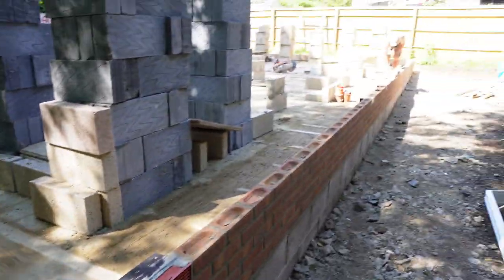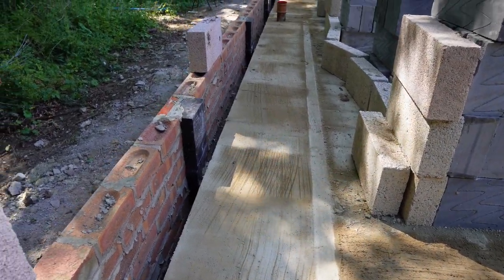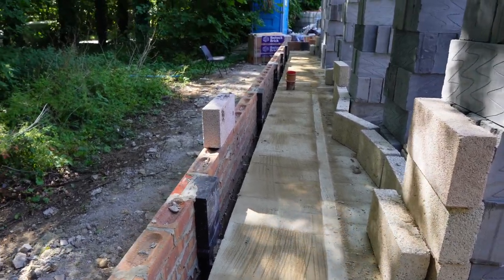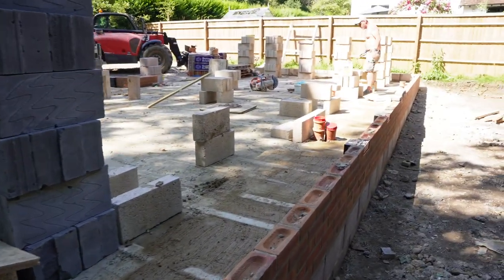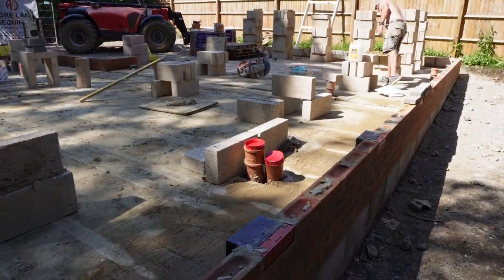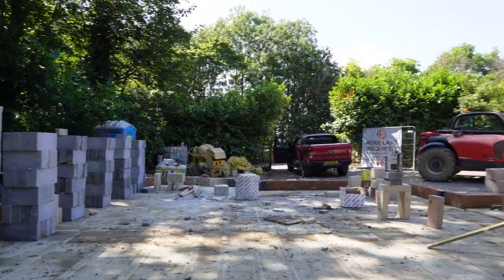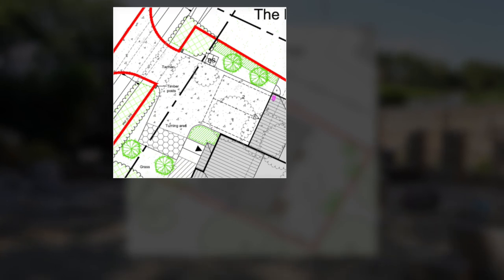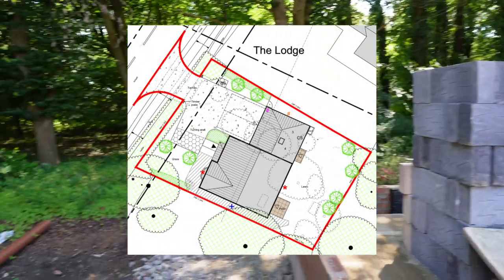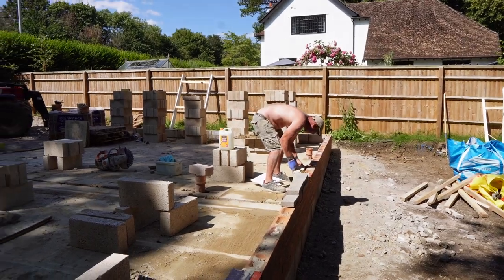Travis have been kind enough to drop me the blocks as and when because they're supplying everything for here. All the brickwork's around. It's been slurried in as well so it's all nice and solid and all the air bricks are in position - every two meters I think it specifies on the drawing. The bricks are a great match for the area - you've got that sun on there, a bit of red and orange in there. I think they really suit the surroundings and the environment.